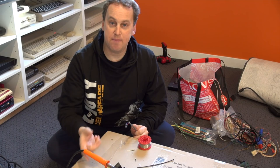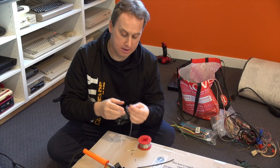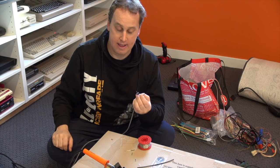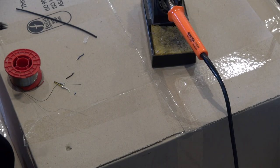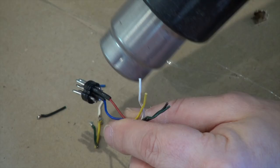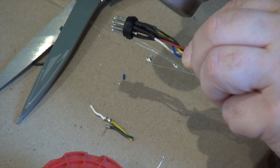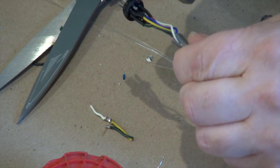I'm down on the floor and beginning to make an RGB cable for the Neo Geo. I've put in the blue wire, which is the centre pin on the DIN plug for the Neo Geo; the other end is the SCART end. I'm not only soldering the pins in — I'm also adding heat shrink so they don't touch each other and the shielding doesn't short anything out, because there's 5V there along with the video sync and the RGB signal itself. You've got to be very careful when doing this.